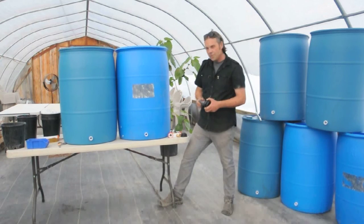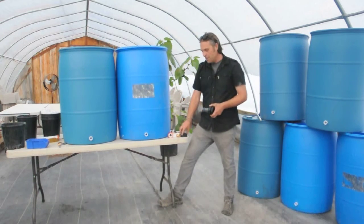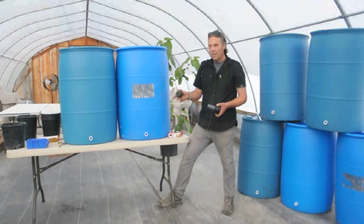So here's how we've solved the problem of the DIY rain barrel class. We've done away with the silicone. We started by finding a nice coupling system, but were finally able to track down the piece we really wanted — a nice two-part bulkhead that's easy to secure, absolutely silicone-free, and easy for everyone to put together. I'm going to get to work on fixing up these rain barrels, and if you have any questions, certainly just let one of us know.